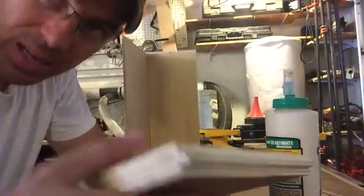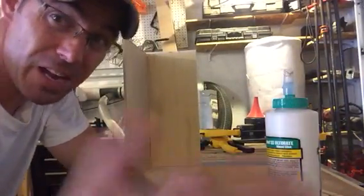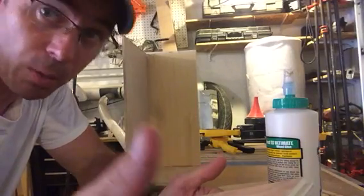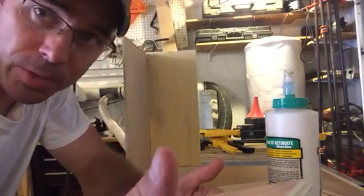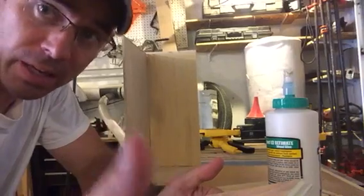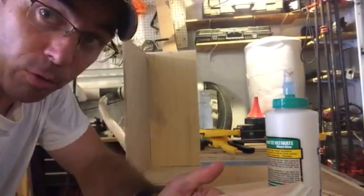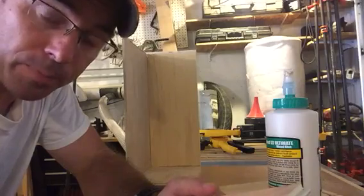Now what glue does is, I'm a big proponent of never relying on adhesives or coatings to do all the work for you because they will fail. It just takes temperature, time, and moisture to kill adhesive bonds. That being said, I'm going to mechanically reinforce these with finishing nails, which you'll see in a minute.